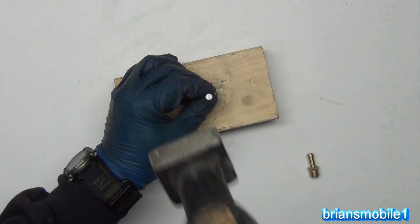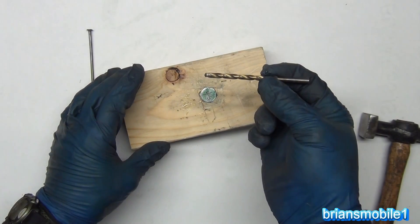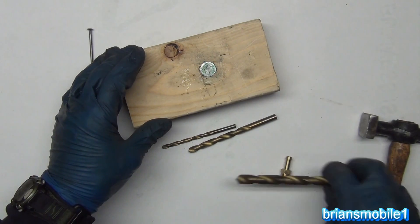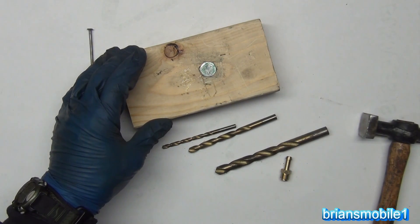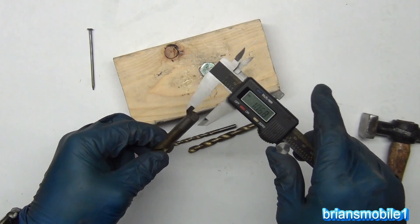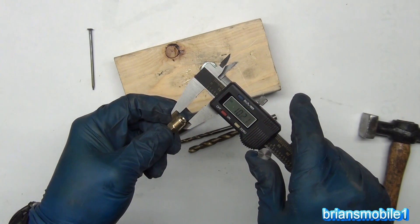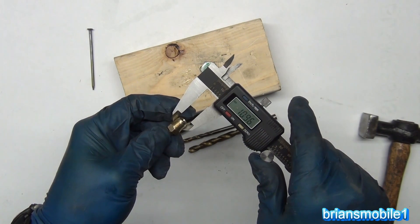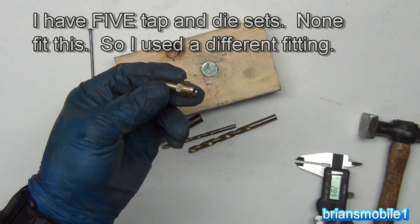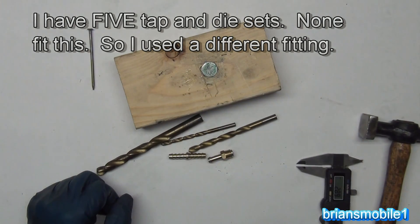Stand it up, give it a little wackity-schmackity with the hammer. Do something small, and then do something a little bigger. The whole time I'm doing this I'm measuring — this drill bit is 10.68 and then this one here is 10.89, 10.72, something like that — 24 threads per inch, through 7/16. Anyway, I might just abort and do this, but I'm going to get my small holes first and then see where I'm at.